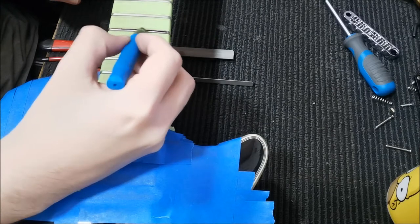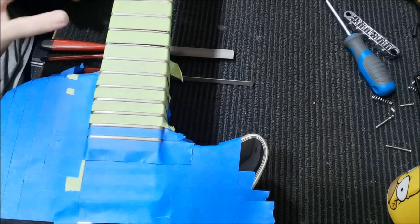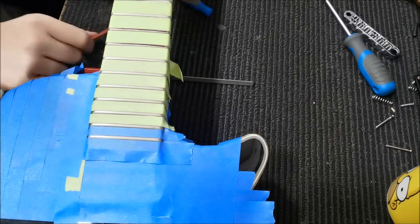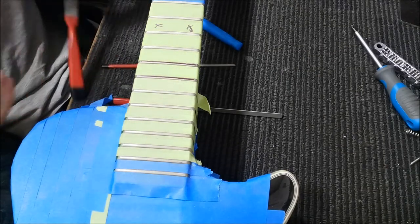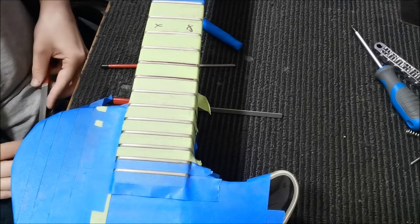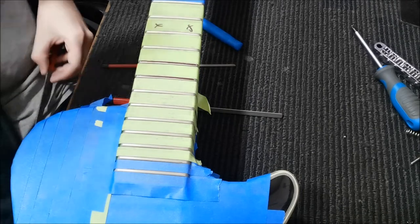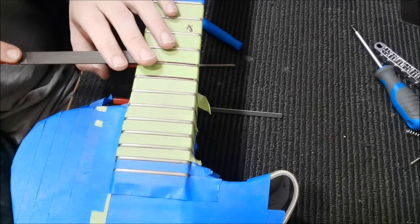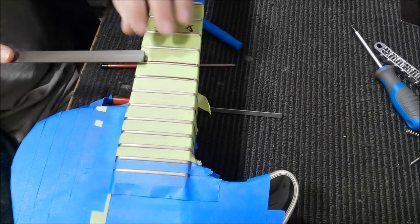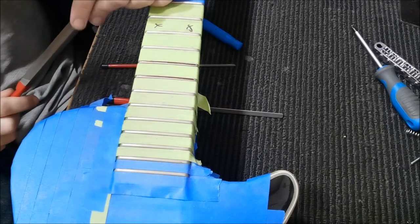We're going to go to the top with a black marker. We're in frame now. We want to make sure our files are clean, so just give it a wipe down. This has recently been used on stainless steel, so I'm going to use a steel brush. The reason I'm using steel over brass is that steel is magnetic so I can pick it up later. We give it a quick clean, wiping away any little bits of metal stuck in the file. We line it up straight — there's a safe edge down the bottom — and then push. These files are one-way; I do have a two-way file but I don't use it.